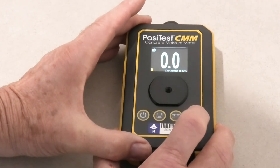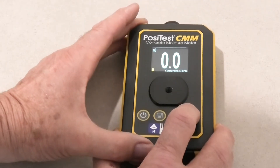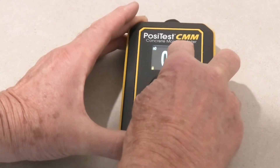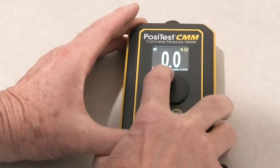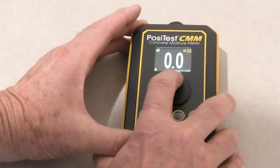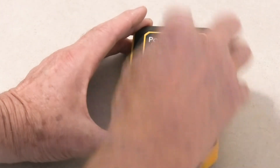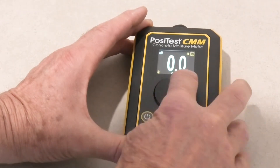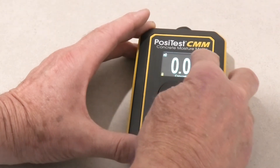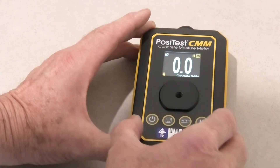The continuous mode will just give you a continuous measurement. What we're going to do is go outside and test. We connect the extension rod and set it to auto measure and save — that's this mode here. We can change what we're measuring: we're doing concrete 0 to 6%. There is also carbide method 0 to 4%, and relative 0 to 100% — that's not relative humidity, that's just relative to another measurement. We'll leave this on concrete 0 to 6%. We've got to set it up so it's automatically saving when it gets a stabilised measurement, and this is measurement storage point 0.